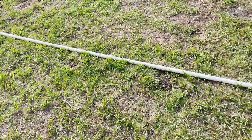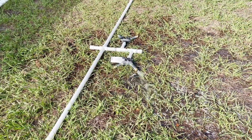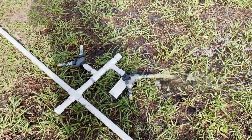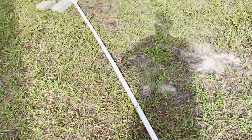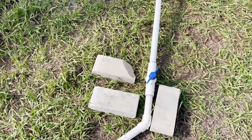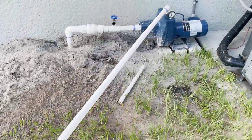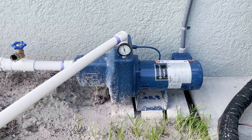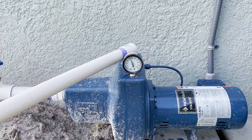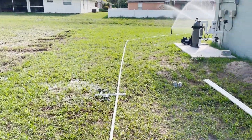I'm running 45 PSI at the pump and I'm still having to bleed off water pressure in order to keep it at 45. I have a shut-off out here that's partially closed, which is creating a little bit of back pressure into the pump. Right here at the pump, you can see — coming out of the ground without a pressure tank — I'm right at 45 PSI.